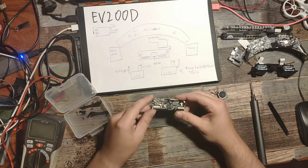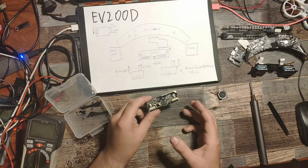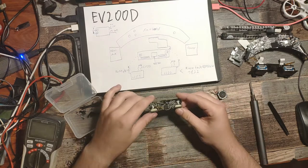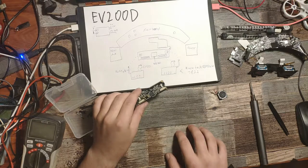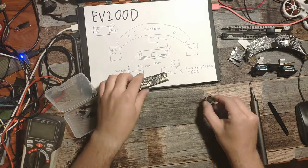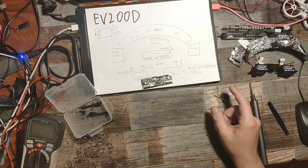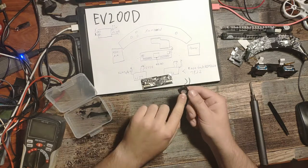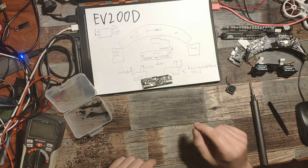I heard that with other chips — like graphics cards with big BGAs — the same problem sometimes occurs. I actually worked in PCB manufacturing for a bit, and we had these problems where not all the balls were connecting. One fix is to desolder the fan and put the board in the oven at about 150 degrees Celsius for around 20 minutes. You have to remove the fan first because the fan has magnets inside, and if you put it in the oven the magnets will lose their magnetic force.